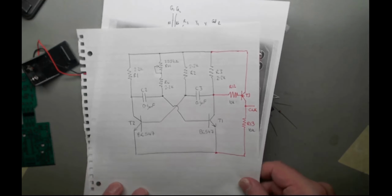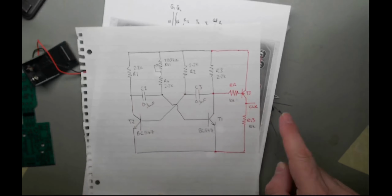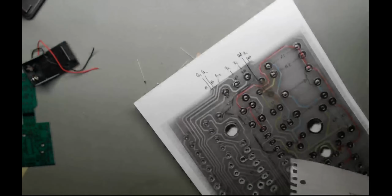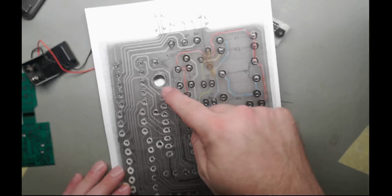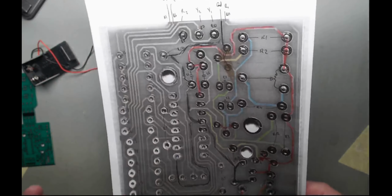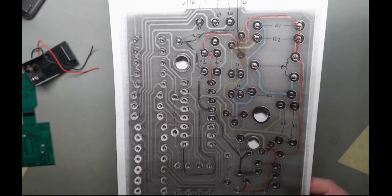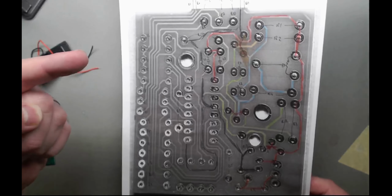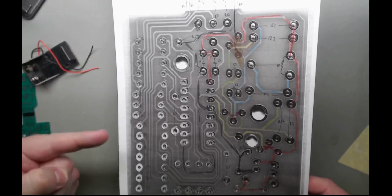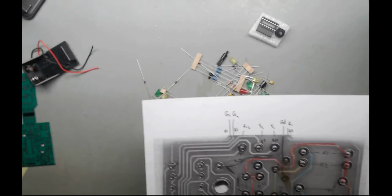But, yeah, so this oscillator just sits here running away, pulsing away, triggering the clock. The clock then ripples backwards and forwards, turning on a combination of diodes, which then turn on the LEDs. So it is literally a state machine. If you wrote this in code, you'd have pretty much, in this state, turn these lights on, in this state, turn this light on, and just have something which iterates through the states if you're writing simple code.